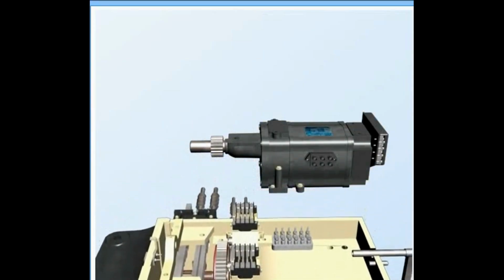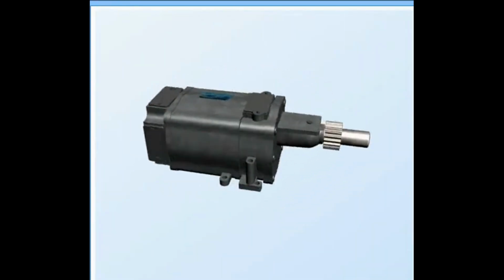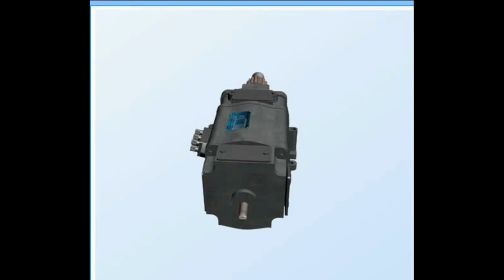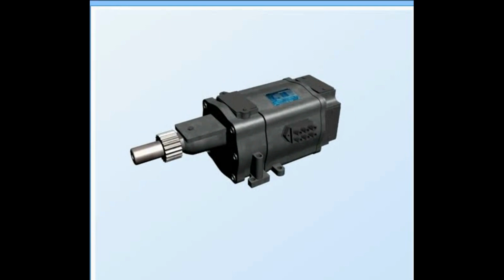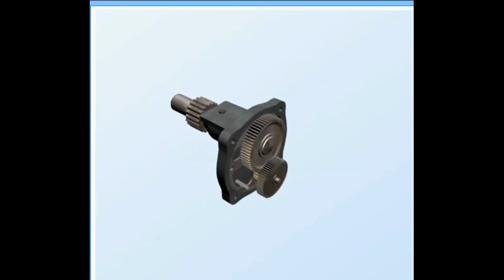Motor. The electric motor converts electrical energy into mechanical energy and operates points from normal to reverse and reverse to normal directions. Specifications of the electric motor: rated voltage should be 110 volts DC, capable of working at plus minus 25% of rated voltage, RPM of 1700 plus minus 15%, rated current 5.3 amperes and maximum 8.5 amperes, operating time of 4 to 5 seconds, power is 440 watts or HP of 0.59, gear oil used is SAE 30 and rating 10 minutes.